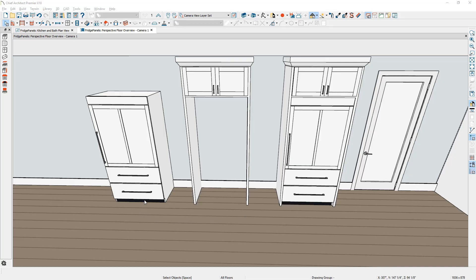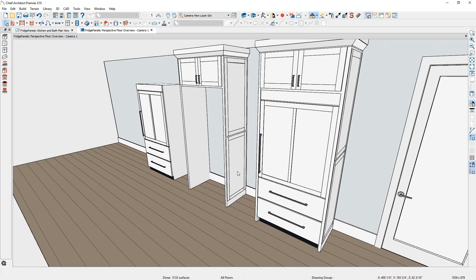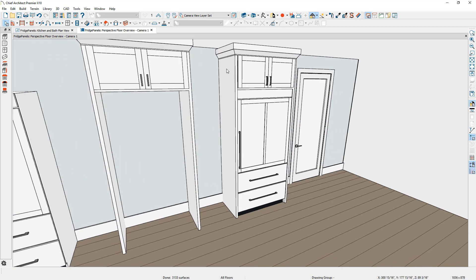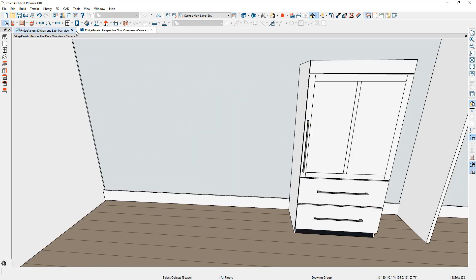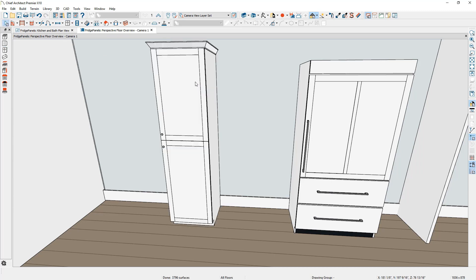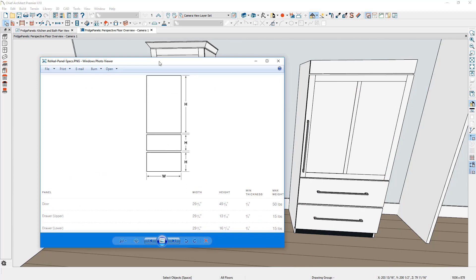In the plan that I have open, I'm going to begin by creating the panelized refrigerator. I'll show you the alcove and the process of creating the end panels when you have them exposed, as compared to an area that's not exposed, and what the difference is. To create a panelized refrigerator, I use the full height cabinet. As you go through this process, you can find configurators such as SubZero's Reveal program that will give you the dimensions, separation values, weight information, and any other specs you need.